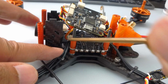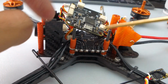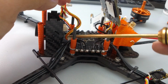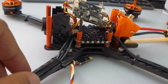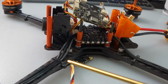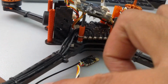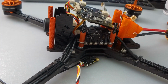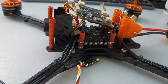Right, so you can either double tape it in, sticky tape that in, or hold that with the cable ties it gave. Okay, so we can mount it somewhere there, and then mount it at the bottom like that, which is fine because again the design of the LiPo at the bottom will always protect the antenna from any impact. Okay, so we'll mount it that way, and then we'll use some spacer in order for the antenna not to touch the carbon. Okay, and you'll have great signal. Okay, so now let's mount it and then solder it onto the flight controller.